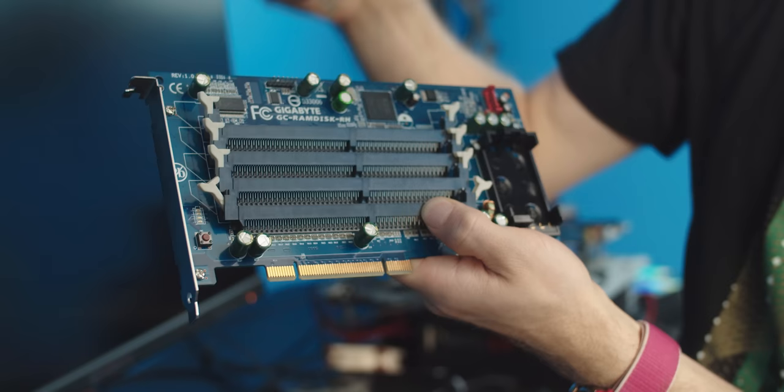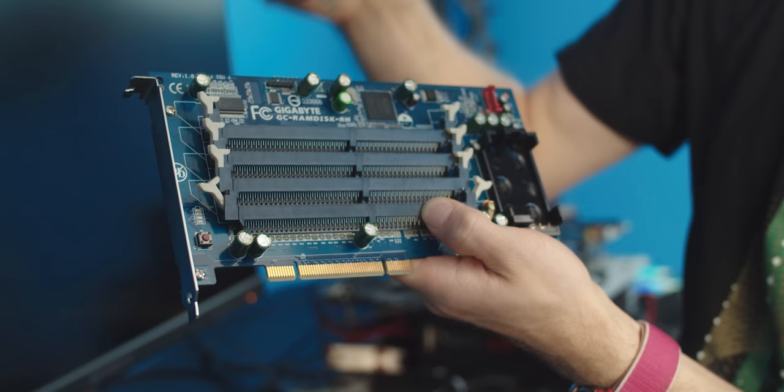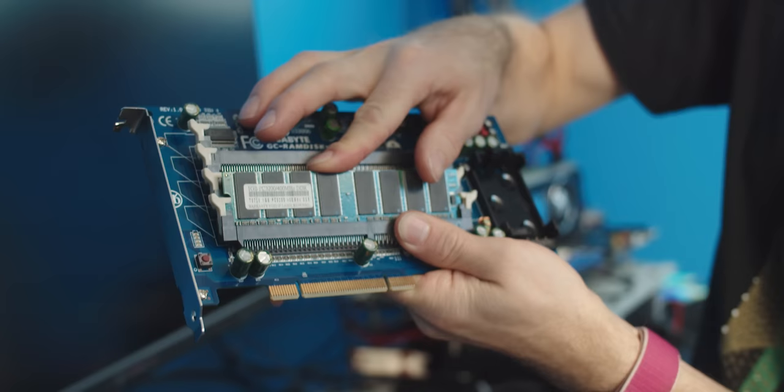Now let's look at the memory slots. These are operating at DDR1 200 megahertz. And while modern memory modules and their controllers would operate at much higher frequencies, even with the inefficiency of using SATA instead of NVMe like we would for any solid state drive today, that is a theoretical limit of 1.6 gigabytes per second between our FPGA and our RAM — as fast as a decent modern SSD and way faster than a hard drive.